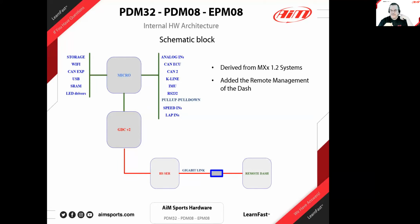I've seen those chips aren't really limiting us to the 1,000 samples, let's say, per second that we allow on some of the channels. But if we allowed it to, say, 2,000, or sometimes I've seen some users that have just turned everything to 1,000 hertz across the board, and then there becomes a point where it gets saturated and the dash can't keep up with the full amount of stuff that's coming at it, including smarty cams and other things that are demanding some of that processing power. So I assume that's what you're talking about.